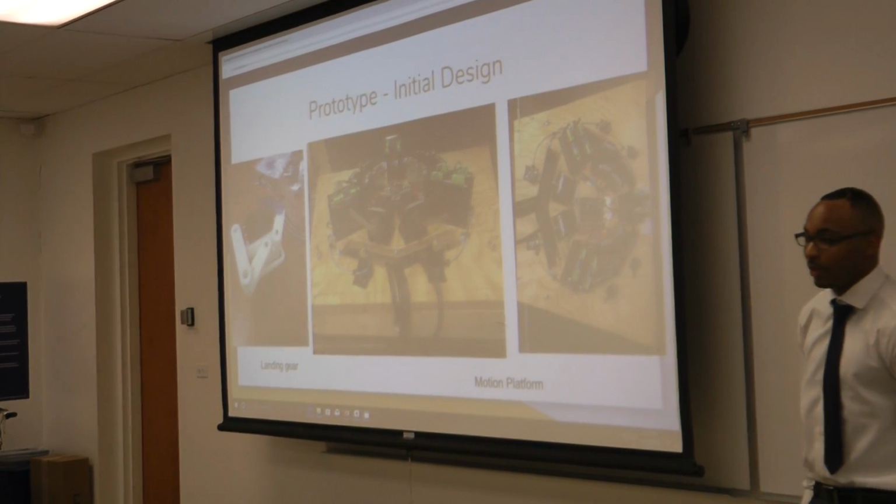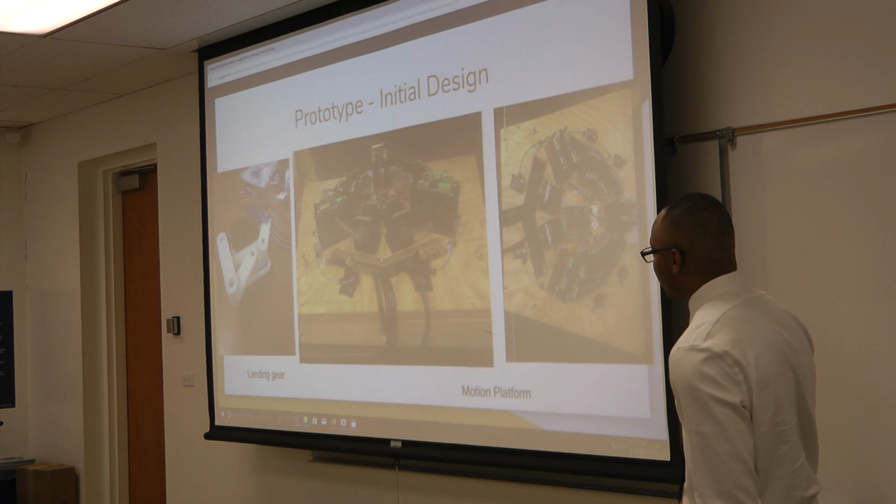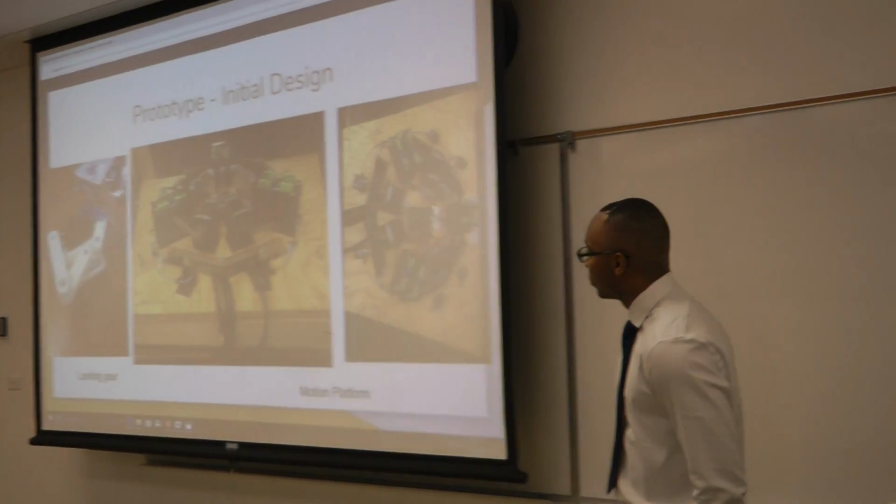The first prototype that we had used one set of drivers first, the L298, the little red ones that everybody has. They did not work as well as we wanted. They didn't provide enough power to the platform, and whenever we put just a simple cardboard tube on it, the platform would collapse on itself.